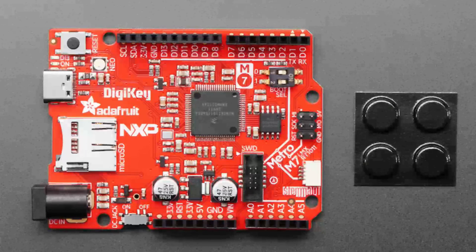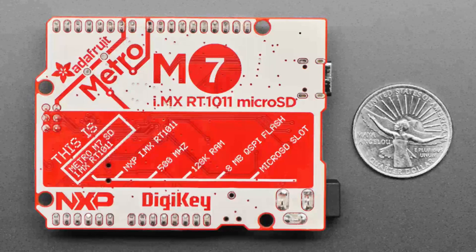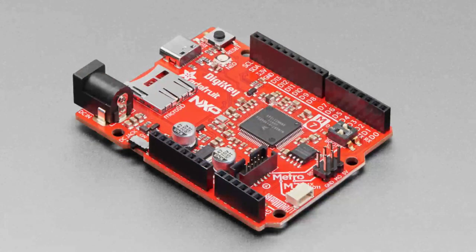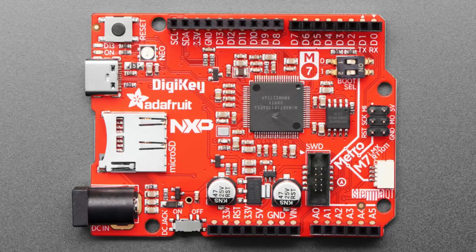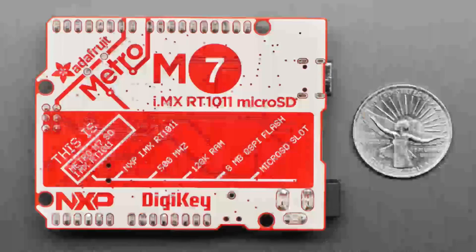There's a built-in NeoPixel, a micro SD on/off switch, and a JTAG/SWD port for step debugging — connect it to a J-Link and use MCUXpresso, which is NXP's IDE. Even though it's Arduino-shaped, it does not run the Arduino IDE. Instead, we have CircuitPython support, which gets you up and running fast with I2S, SD card, digital I/O, PWM, and analog. Or you can use NXP's IDE, which gives you full power over every register, every byte, and all the caches via the ARM Cortex CMSIS core.